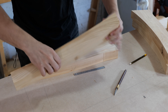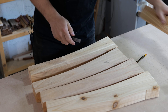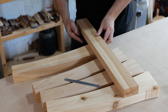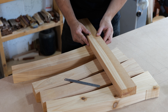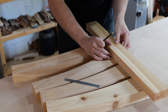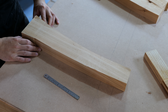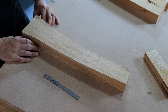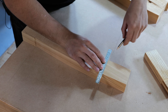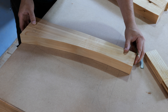Let's get all the components lined up systematically so I don't miss any of them. I'm going to mark some boundary lines so I don't scratch that bridle joint all the way up the side of the leg — I'll know exactly where it needs to start and stop. I'll put a simple line where the foot is going to end. Then I'll scratch this line on them by simply lining it up with the rod — I can do this by eye at this point, it's only a rough mark.